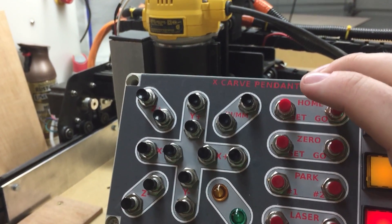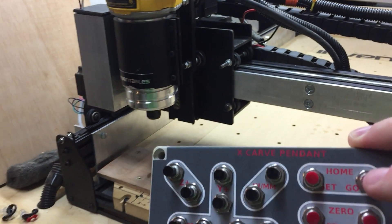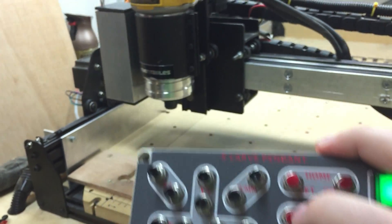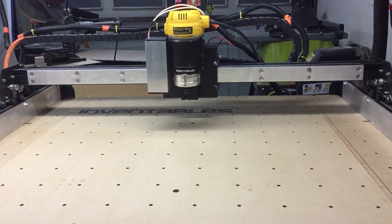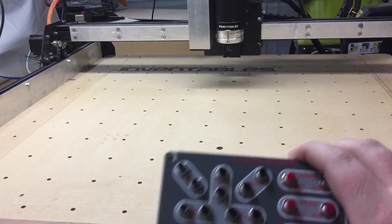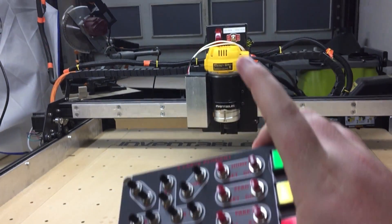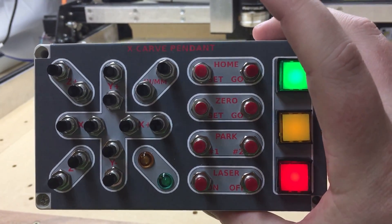You can go back to inches if you want to move around. You can set the zero, and you can send it back home if that happens to be your zero point or where you do your tool changes. You can also send it to your first park position — for me, that's Z all the way up and middle back, which clears the whole table away from whatever workpiece I'm working on to add a new piece or get ready to cut. The laser is currently disabled; there's a switch that switches between laser and spindle.